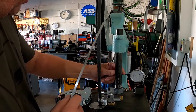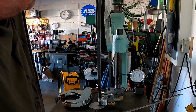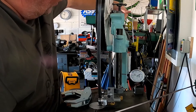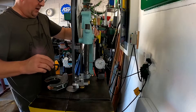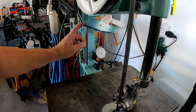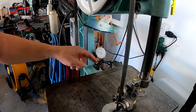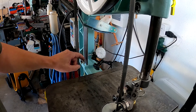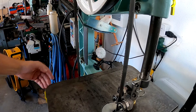We know that the movement is amplified, so we're going to have to simulate that amplification back here - because we know that at this point is where the only force can be exerted, so somewhere before this point is where that twisting motion has to be. We're going to take this precision straight edge, put it back here and clamp it on, put the dial indicator on there zeroed with a little preload, then turn this on and see if we have any twisting motion in the column.